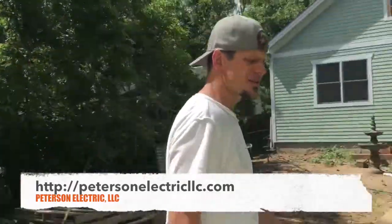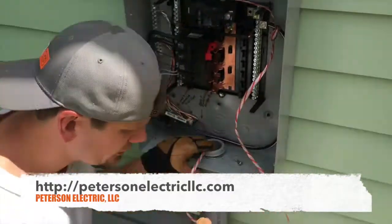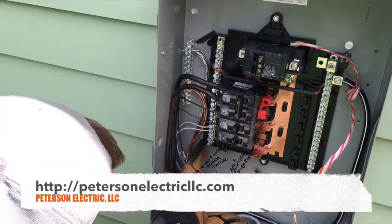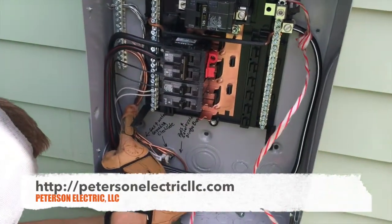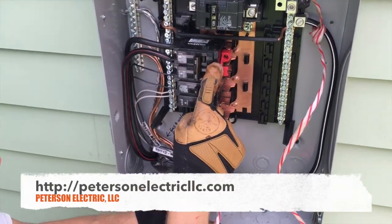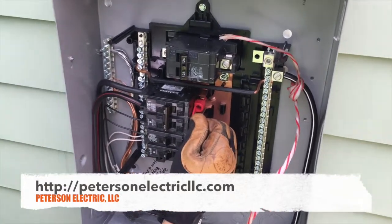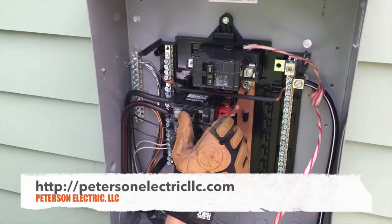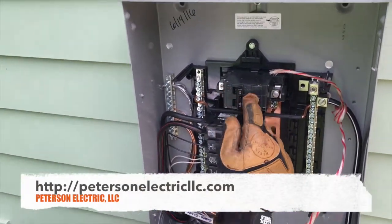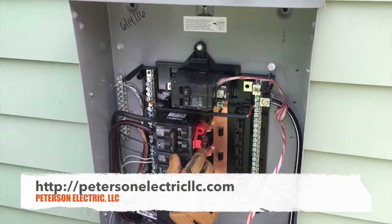You have to keep in mind that because this is a sub-feed, you have to separate your grounds and your neutrals — which is your grounded conductor and your grounding conductor. Right here is going to be considered your grounding — your bare — and here is your neutral tying through to here. This is going to be my sub-feed to upstairs. We do have to use a breaker clip inside of here to tie this down. At 100 amps we're sub-feeding upstairs, but we're feeding 125 amps once we get this pulled in.